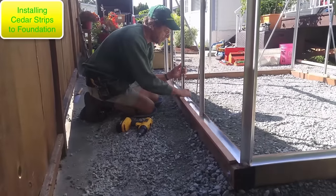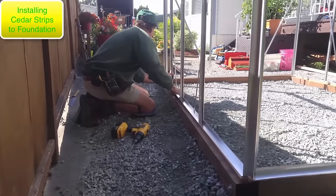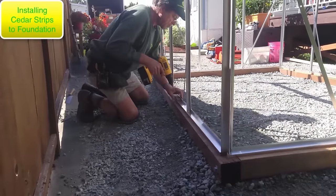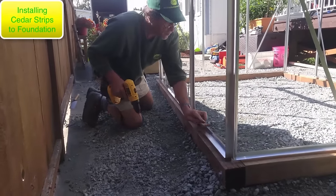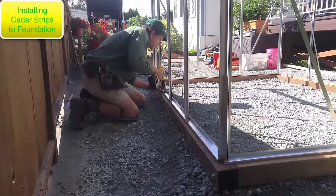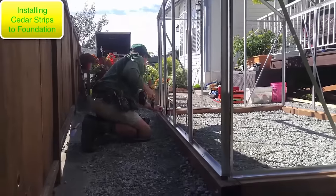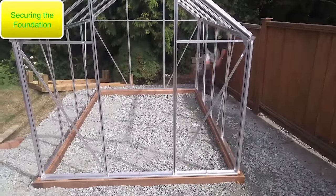We've slowed the video down so you can see how I'm inserting a cedar strip underneath the sill plate of the greenhouse. The sill sits on a piece of cedar on top of the 4x4 foundation. I've lined it up and I'm using a measuring stick to measure right into the center of each bay, then pre-drilling a pilot hole — these are the only holes you'll have to drill. I'm putting in stainless steel one-and-a-half-inch pan head screws, but not screwing all the way down — just about a quarter inch into the cedar — so I can still move the greenhouse around to position it properly on the foundation.